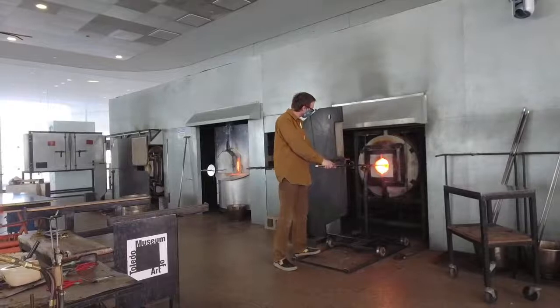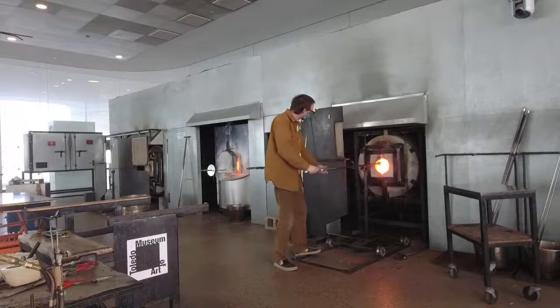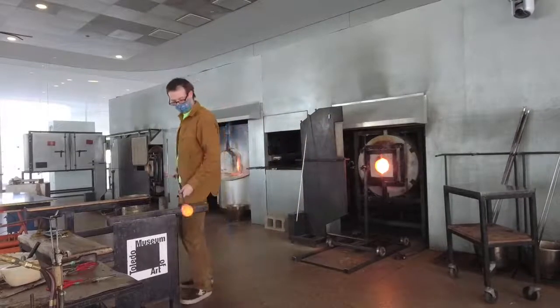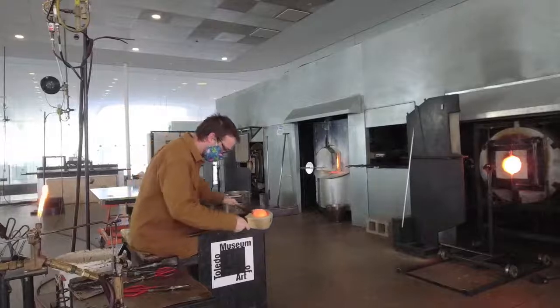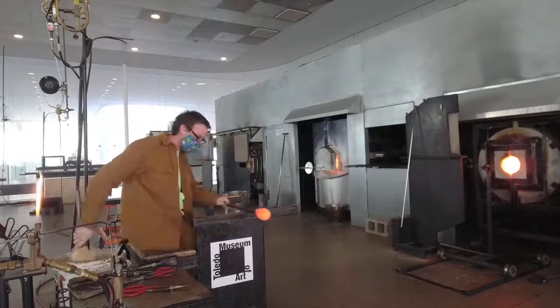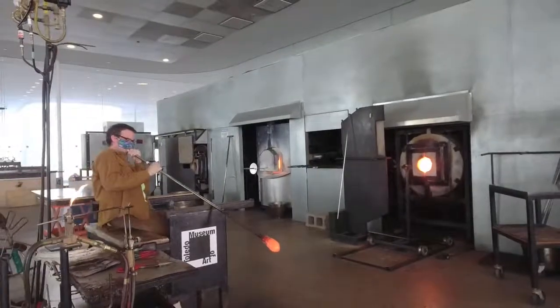If we were to come out of the furnace and just turn really evenly, eventually that glass wants to go back into that Q-tip block shape. But this allows us to work a little bit quicker. When we're working in here, heat's sort of the name of the game. So Sandy really has to work as quickly as possible once we're out of the furnace to take advantage of that heat. Because the glass comes out at 2100, that's really the hottest it'll ever be. Working temperature is somewhere between 1500 and 1900 realistically.